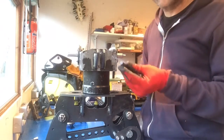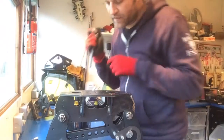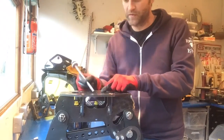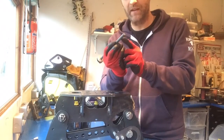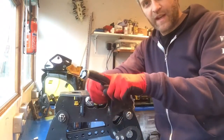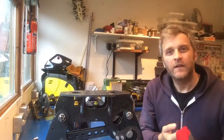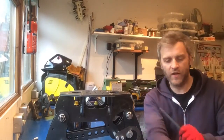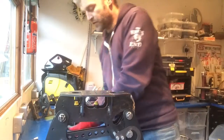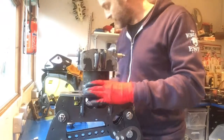I might just need to turn down the end of that a little bit because it's not quite fitting into the collar. The problem is it's not passing through the steel plate - this shaft is slightly over 10mm, so I've had to turn it down to fit the clamp and the bellows coupling. I'll just turn down this shaft a little bit further so it fits nicely into the collar clamp.